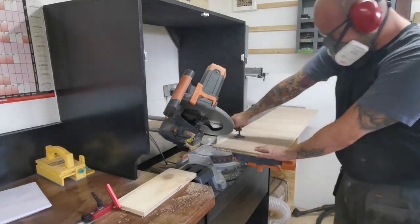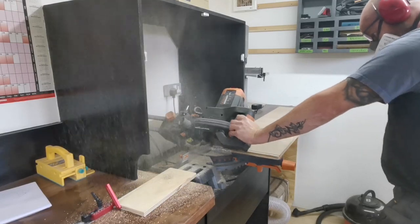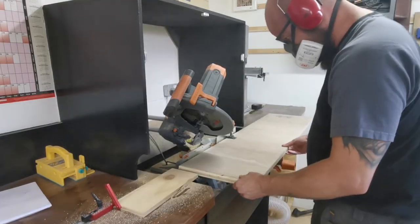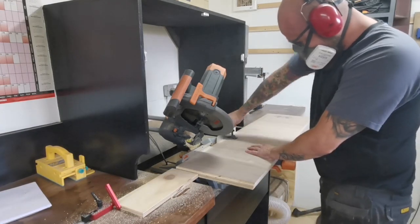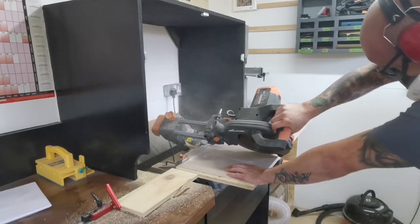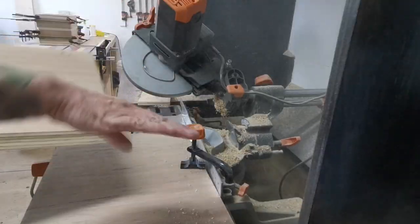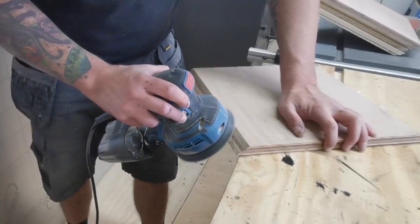One thing I will say when you're doing these mitre joints, guys — take a lot of time setting up your mitre saw, making sure that it's cutting really precisely at 90 degrees. And then when you put the bevel on at 45 degrees, set that up really accurately as well, because this is going to pay dividends later on when you come to glue up and you don't want to be filling big horrible gaps in your mitres. You want the smallest gaps possible, if not none at all.